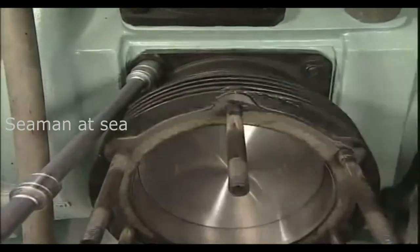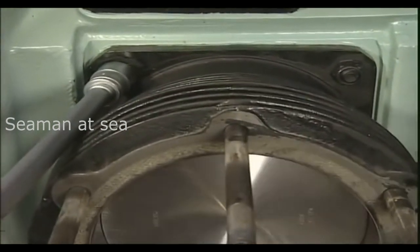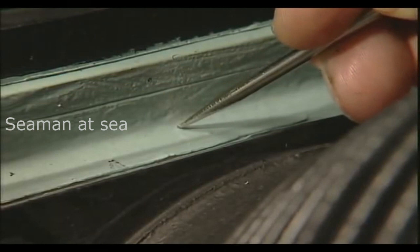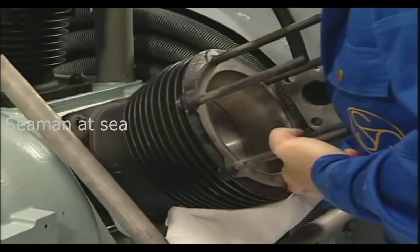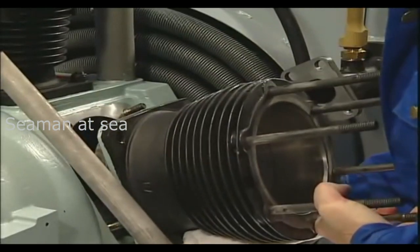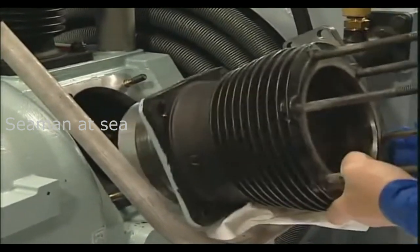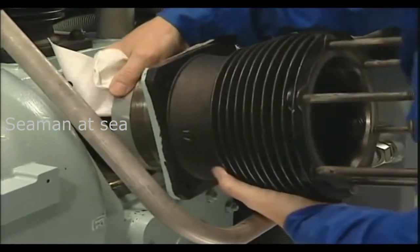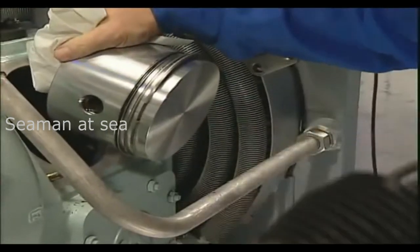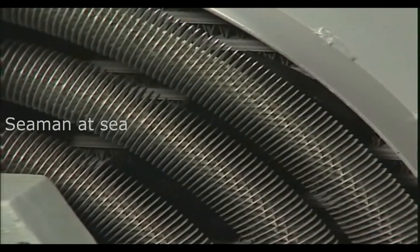To remove the cylinder, first the cylinder base nuts must be loosened. A small mark ensures the correct position for the cylinder during reinstallation. When removing the cylinder, the piston must be rotated to the bottom of the stroke — lower dead centre — and held in place securely, so that it does not strike against the crankcase or the threads of the studs. Take great care never to damage the piston surface. The piston must be carefully handled and safely positioned to lower dead centre by rotating the flywheel.